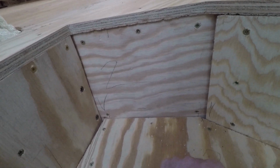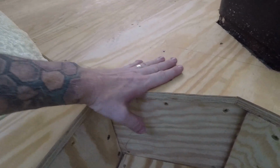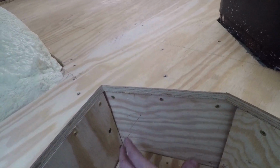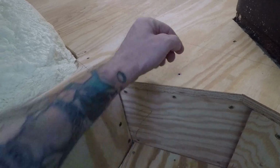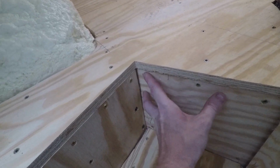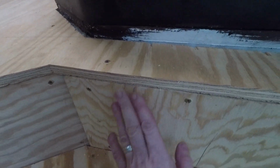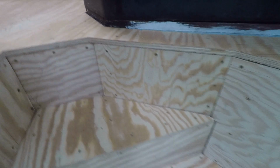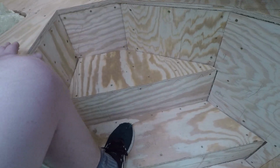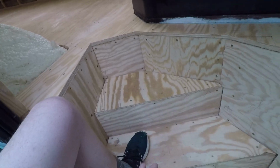And there we go. You see this, the plywood on the subfloor here, I made it so it hangs over. So when I added this plywood here, it was hanging over 1/2 inch over the framing. So when I added 1/2-inch thick plywood here, it's basically flush here. And this is super solid. So the steps are now both insulated, framed, and subfloored, and they're not flexing or anything.